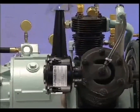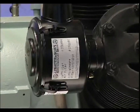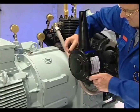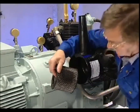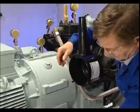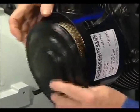The air inlet filter element cannot be cleaned. It has to be exchanged when necessary, at least annually, but at the latest after 1,000 operating hours. To replace the element, open the clamps, remove the cap, replace the old air filter element, and close the air filter again.